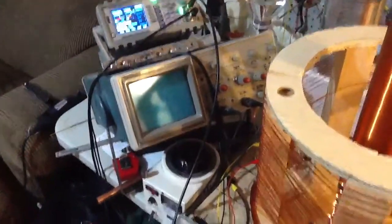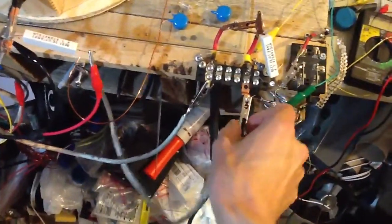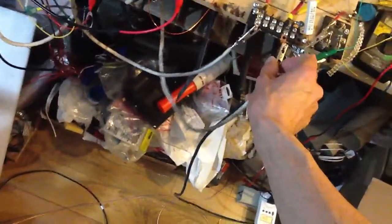Still just using the signal generator at about 1.052 MHz, and that's going into the primary on this coil. It's tuned up for that frequency. This is the ground here, and we've got this coil grounded to that other wire 10 meters away. I'm just going to pull the base of this coil off the grounding and we'll see what happens to this transmission.